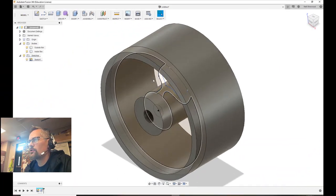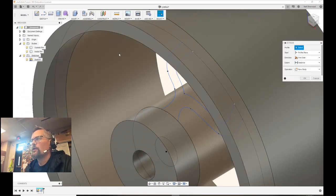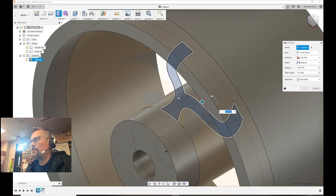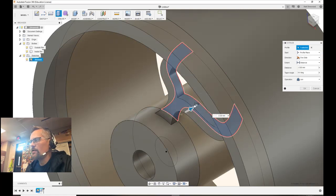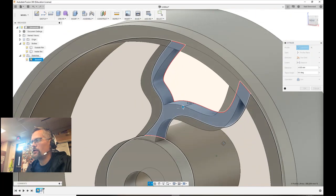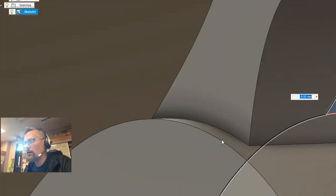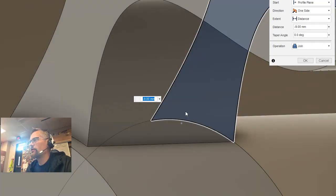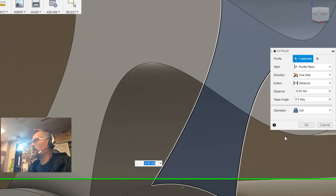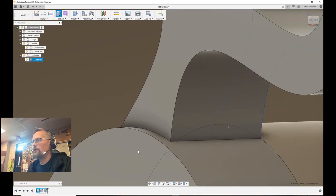I'm going to go back to a home view — an isometric view — and I'm going to go ahead and do an extrude. So this is going to become a pattern, you might have guessed. I'd rather do my pattern after I make it 3D because I want to do some extra detail work on it. Notice it's only kind of on the front 10–20% of the rim. I also don't want to run it all the way to the edge, so I have a little gap left there. I don't want to do it all 10 millimeters out because then it will connect, so I'm going to leave it at 9.